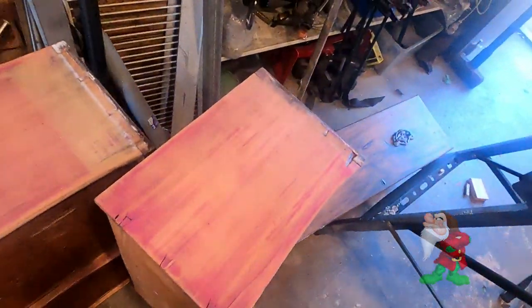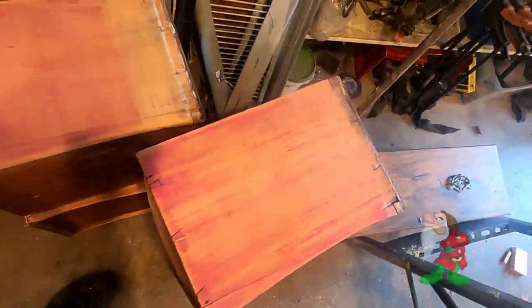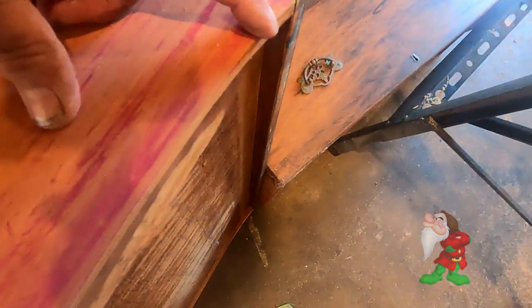But I think that's all, I'm going to have some lunch. And I'm gonna do these. I should have enough over there, that 12 by 12 to put in here. So I'm only gonna take from there out down to there and just replace this bit in the middle, because this stuff here I've got for the runners is perfect. So I'm gonna cut it out with that blade, glue and nail it in, so I can nail it to the other bit. I'll do that after lunch, and then that'll set overnight, and then I'll get into doing the rest of this.